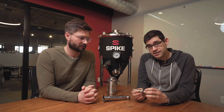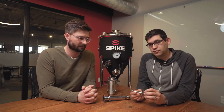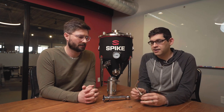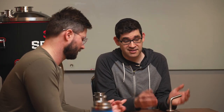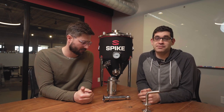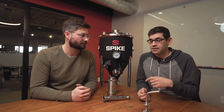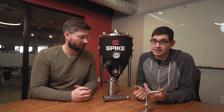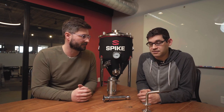Next we've got the racking arm, which is one of our most popular accessories. It's got an indicator on it and you can swivel it without leaking. This allows you to kind of swivel it, hit your yeast bed, and pop it back up so that you get to that clear beer area — then you can rack that beer out through this, making it an easier process. And finally, we have our CIP ball, which really helps with cleaning. We all know cleaning sucks and takes up a lot of time. With a unit tank, you just put this in through the top, run your cleaner through it, it spins and sprays that cleaner all down the walls, making it far easier and much less time-consuming to clean your fermenter and get it ready for the next batch. Then you can go do other things while it sits and cleans.